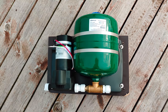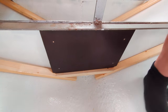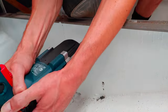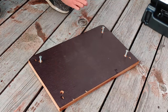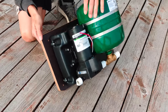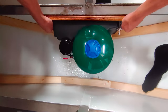Next, I'm going to install the main fresh water pump and accumulator tank. This is needed so you don't get the pulsations from the pump and instead get a nice and steady water flow, just like in your home. To mount it, I'm going to have to attach a plywood plate to the steel, so that means some more drilling. Then I can attach the accumulator kit to the plywood plate, and finally bolt down the whole thing to the steel.